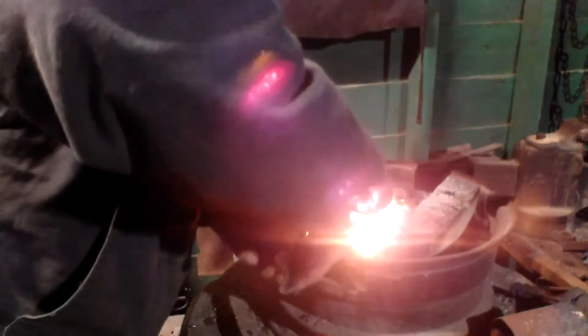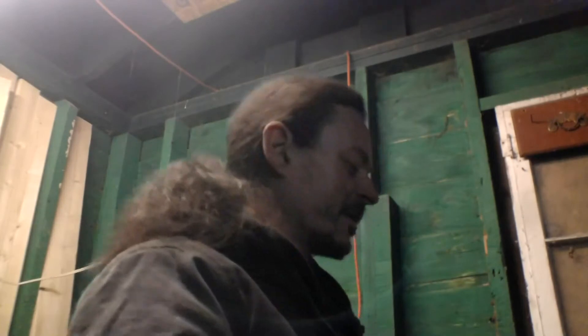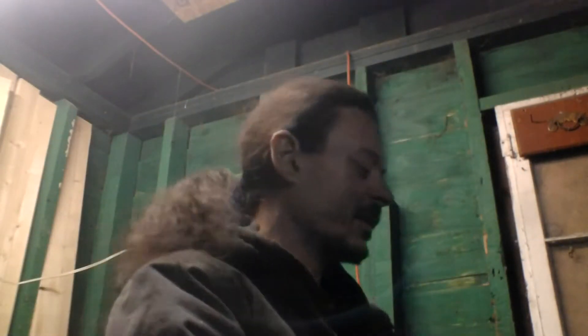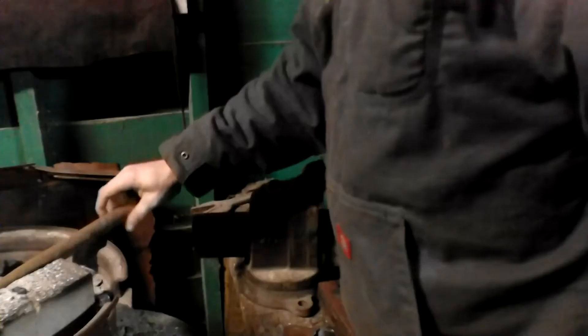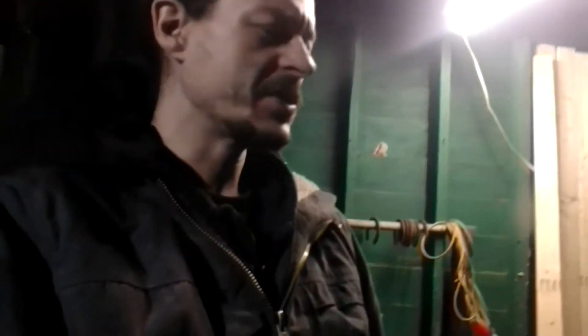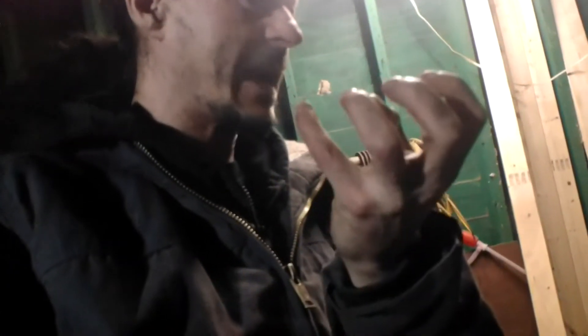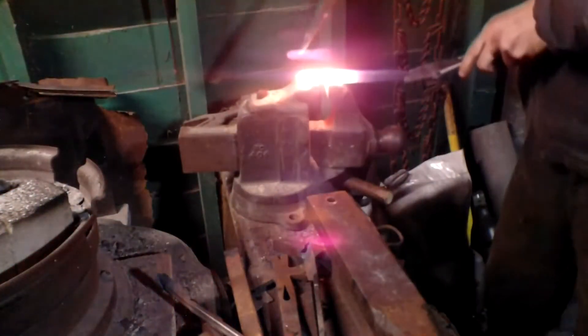Back in the fire. Forgive me ladies and gentlemen, I'm a little impatient. Been out here for like six hours making all sorts of crap and my feet are frozen numb. Trying to hurry it along a little bit. As weird as it seems, I have the hole punch in there too. I'm just going to get it hot enough where it doesn't cool down the piece. I want the inside to stretch and I don't want it to stop and then crack because if it cools off too quick, that's what's going to happen. Wrought iron can be a royal pain in the ass for an amateur like me who's trying to get used to dealing with its craziness.